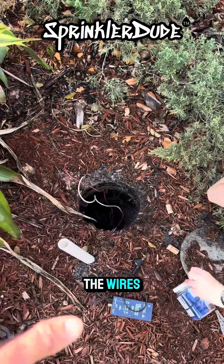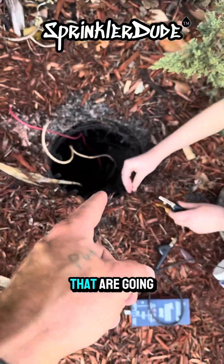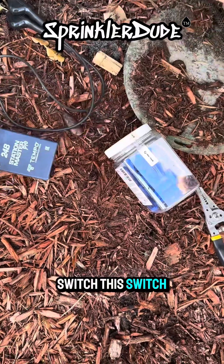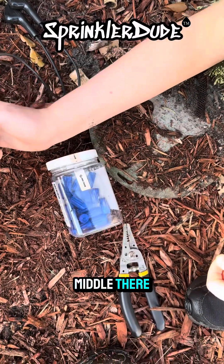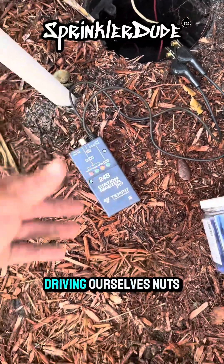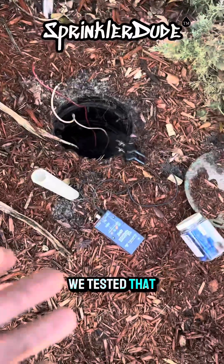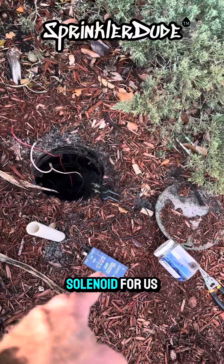Before we can actually go and connect the rest of the wires, we want to make sure the solenoid here works. We're going to use our Station Master Pro to test that solenoid. Go ahead and connect to the black wires down there that are going to the solenoid. Good job — you're using the teeth there, that's going to hold the wire a lot better. You got it connected. Now come over here and switch this switch to activate solenoid, all the way to the left. Well, guess what — that solenoid is no good. So even if we were to fix this wire, we'd have been driving ourselves nuts because that solenoid doesn't even work. That's why you've got to test everything. This tests the solenoid for us, and we now know the solenoid's no good.